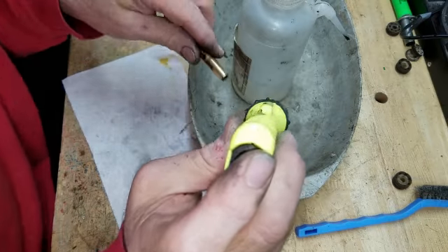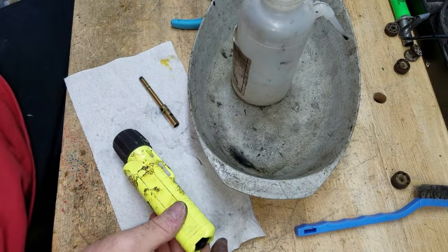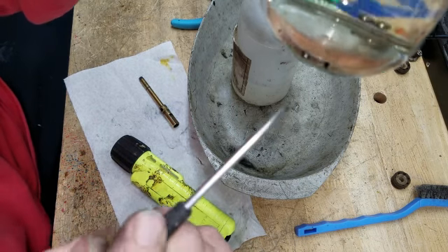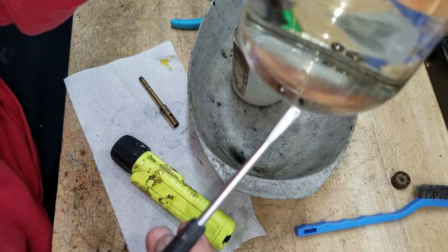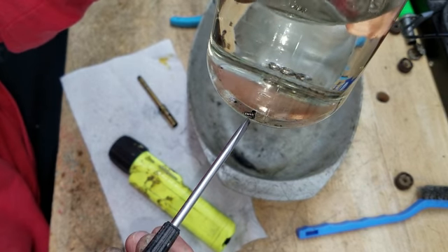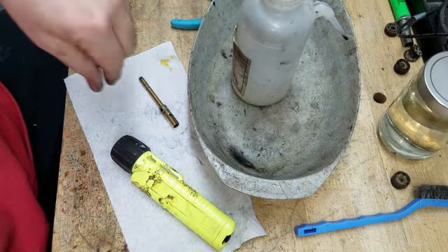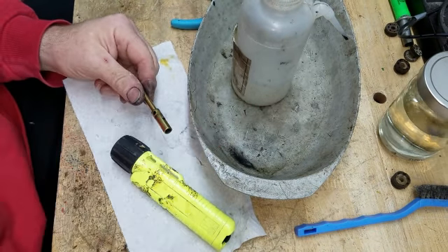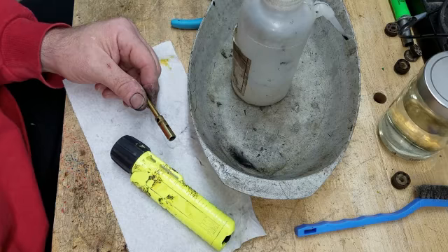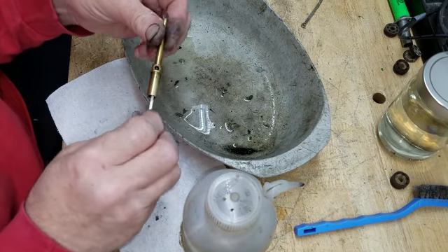It's cleaner in there, and you know why I couldn't get the ball out? Because it wasn't a ball. Let's see if you can see this in the jar — right there, it dropped out when it sat in the lacquer, which is exactly why I wanted it to do so. Now all I have to do is make sure that spring is clean, drop a little bit of lubricant down in the shaft, and then very carefully drop this back down into the spring. I like that better than a ball because I can take it with the screwdriver and guide it down the hole and get it into the spring. Lacquer thinner is cheap too, all things considered.